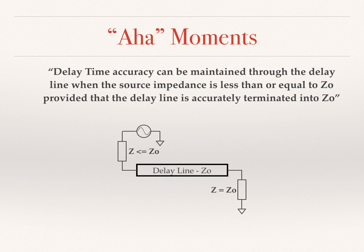And finally, another challenge was, what do I do with the delay? How do I achieve this time delay and have that time delay be independent of frequency? How do you provide a stable time delay over such a wide range of frequencies? For this design, I did choose to use the long-established coaxial delay line. But the challenge is that the delay line will only have a stable delay when it is terminated into its characteristic impedance. It is challenging enough to satisfy the requirement on the combiner side of the delay line if you are trying to provide wide bandwidth as well as low noise.